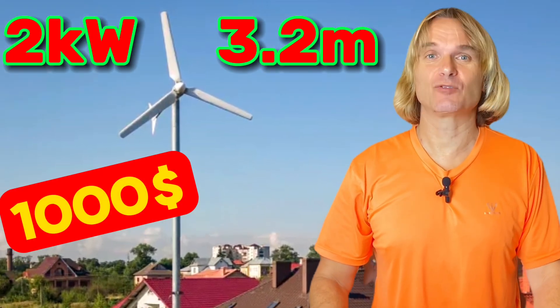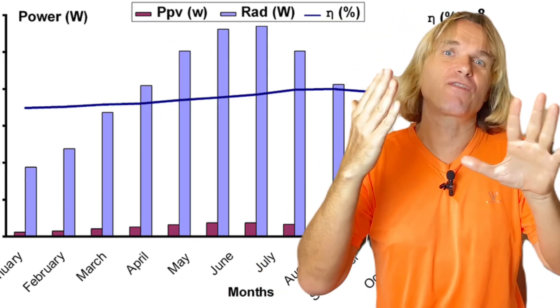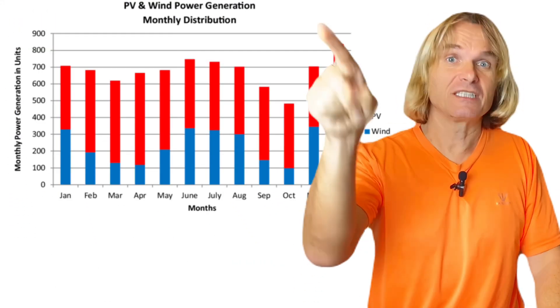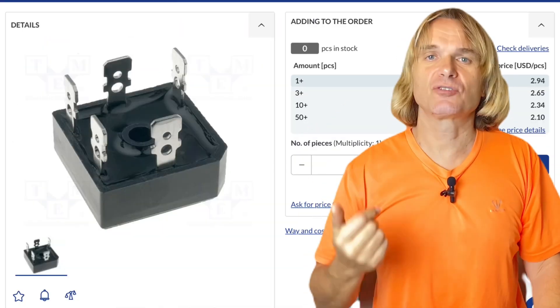This is a two kilowatt wind turbine for home use, which works with a PV system. You may have found your PV system rather lazy in winter and autumn — the whole trouble is that the sun is lazy in winter, giving maybe four or five hours at 20% capacity max. With wind it's the opposite: around 70% of yearly production comes from these colder months. This means if we connect a wind turbine to our existing PV system, we can produce energy in winter.